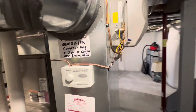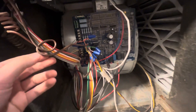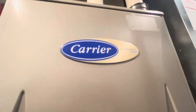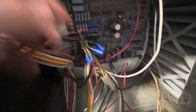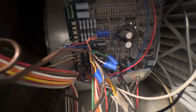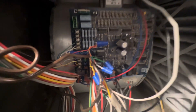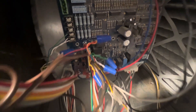What you can do as far as wiring this into the thermostat — you have to get down to the board here. With the power off, we can see this is coming down from the thermostat. We have our standard connections into the bus here. The Performance line is non-communicating, so yellow and red is our hot and we're using blue for common. But the brown and the orange are what we're using for the humidifier. Since they're dry contacts up there, we have to get 24 volts up to the thermostat for the accessory port.